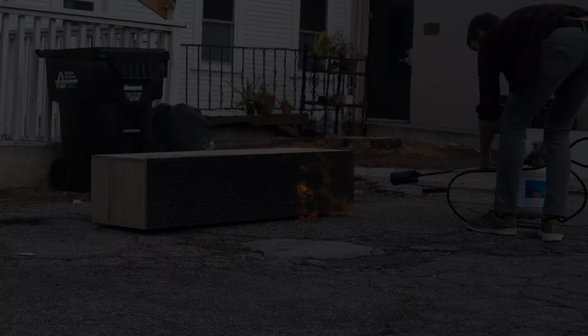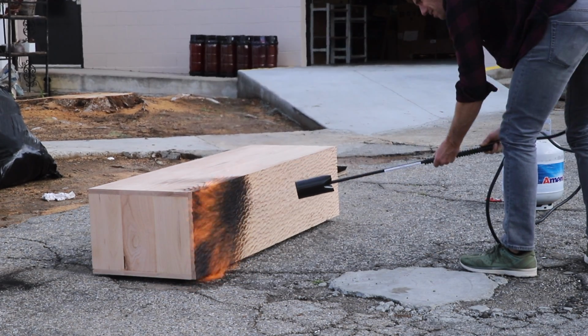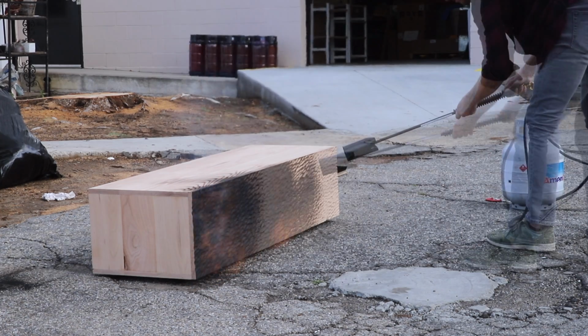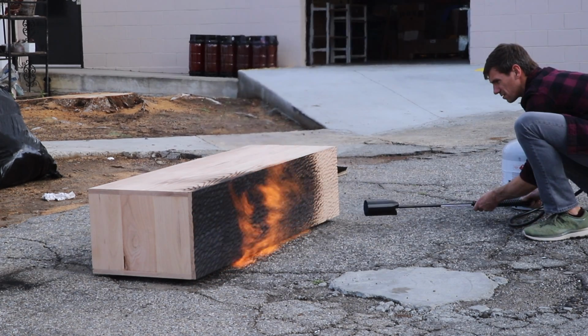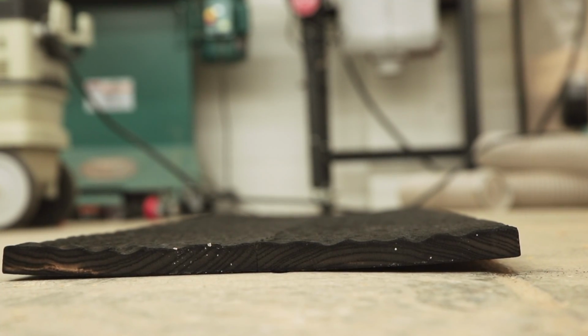With all the facets on the face of this cabinet, I had to spend more time burning on the face in order to blacken all of these divots. Looking back, I believe this extra heat applied helped to weaken the door panel that was already compromised by power carving such thin 3/4 inch material. This is the moment when I realized the door was curling out away from the cabinet.